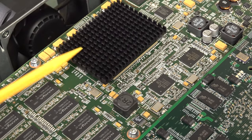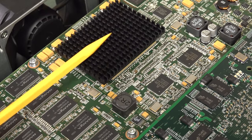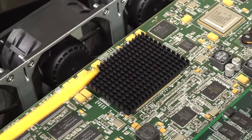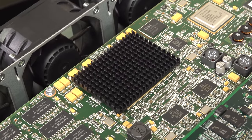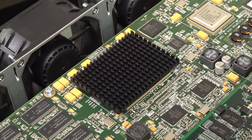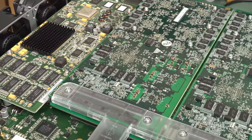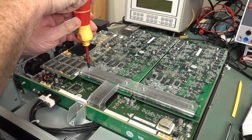If you flipped them around the other way, so you had mostly the flat part facing the airflow going through, you'd get turbulent flow and all that sort of stuff, and you wouldn't be able to get the heat out of there as effectively. You're effectively blocking that airflow. So yep, they've chosen the right orientation there. That's not by accident. That's all part of good engineering thermal design. So this really is quite amazing.